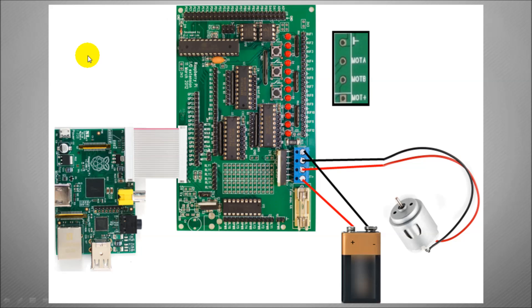So this is how you essentially connect up the entire rig. You connect your Raspberry Pi up with its ribbon cable, and then you want to make sure that the bottom pin on your GertBoard gets the positive pin on the battery and the negative goes to the top. The motor actually doesn't matter which way around you plug it in. What we're going to show in this video is the motor going in one direction and then spinning back in the other direction.